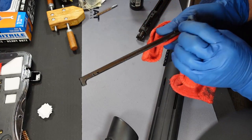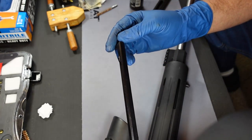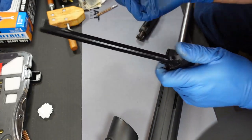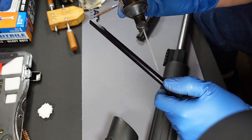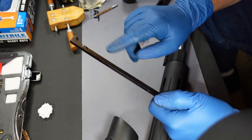The charging lever is aluminum, so it's soft, and dragging across steel it will get more wear. So oil it as much as you're comfortable with. Now that said, some people will say only put oil in certain spots — and if you're in a dry climate that's valid because dust can accumulate and cause gumminess.